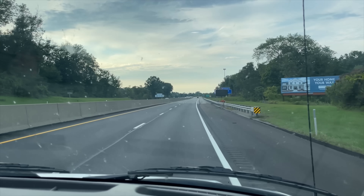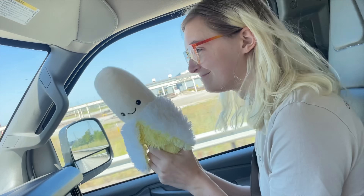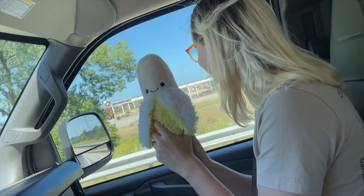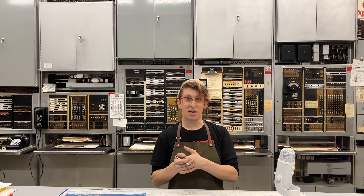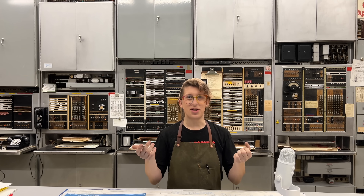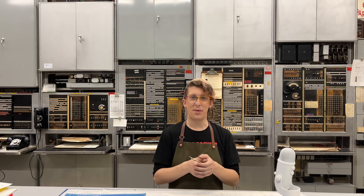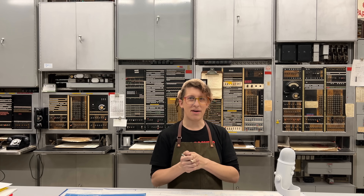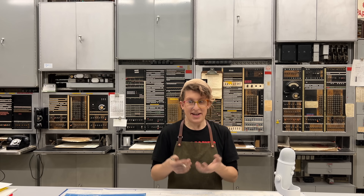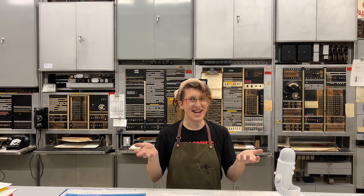While I was on another cross-country drive, Jay actually got the DC motor spinning. They figured out where the commutator and field connections were and just applied voltage to it with a portable power supply that we had lying around. It took some work to loosen the frozen bearings, but after that was all done, it just ran. It was super exciting.